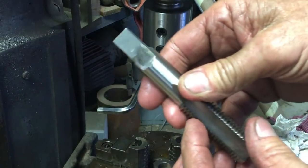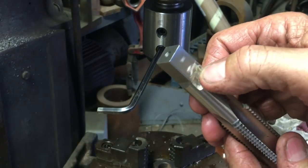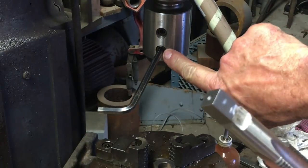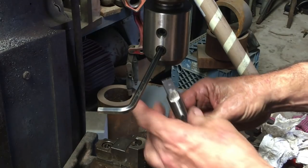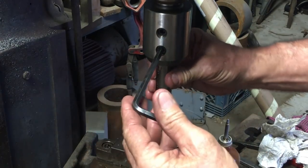Here I did the same thing I did to the 20 millimeter tap. I wanted the tap to go into that slug as far as it'll go, so on one side I just ground it a little farther down so the tap would go up in it farther.